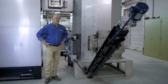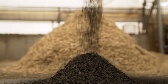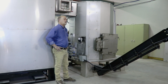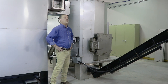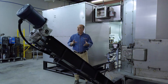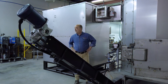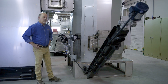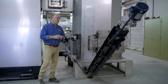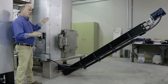Let's talk about the biochar feature. We put the biochar option on all of our machines now. It is automatic and continuous. The machine itself will burn about 200 pounds of biomass per hour to get your million BTUs output. If you burn 200 pounds of properly sized wood chip you're going to get about 20 gallons of biochar out. It's all automated — the machine knows when to turn itself on based on how long it's been in what we call a stable mode, and it will turn itself off when it's going back to sleep.